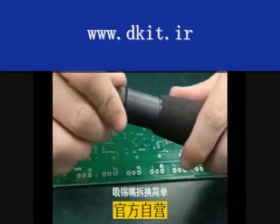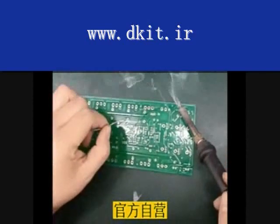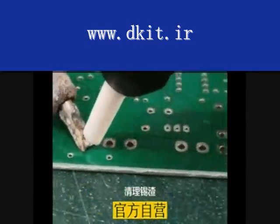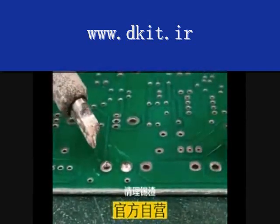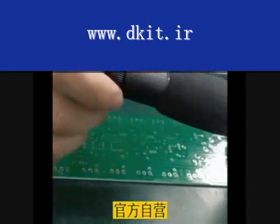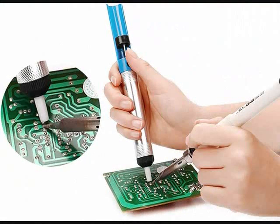Step 2. The molten solder should be vacuumed up. Without applying pressure, place the desoldering pump tip on the solder pad and melted solder. When the spring is released, the piston returns swiftly. This generates a vacuum that draws the molten solder into the pump. During operation, the pump's tip may melt somewhat. Most pumps have replaceable tips or are inexpensive to begin with, but you may try to minimize damage by stopping for a few seconds after melting the solder. Melted solder can harden fast again. Only use one terminal at a time.